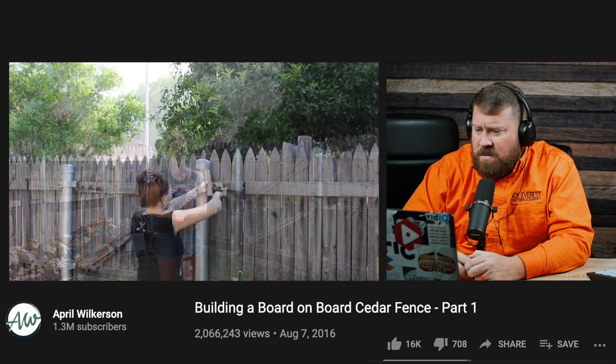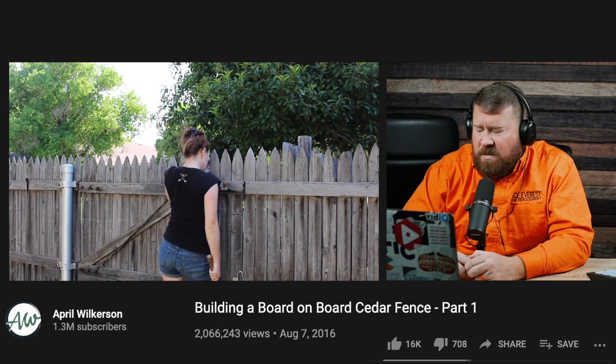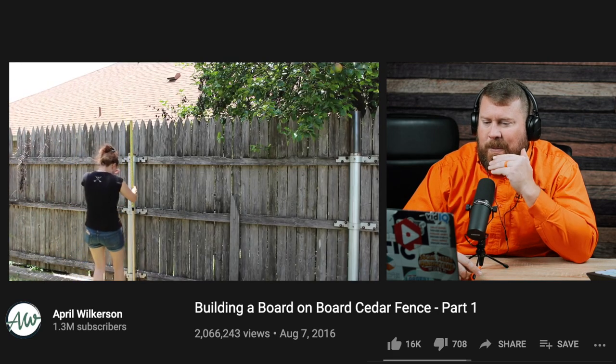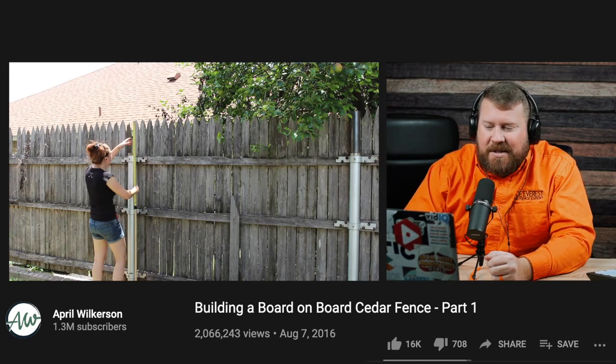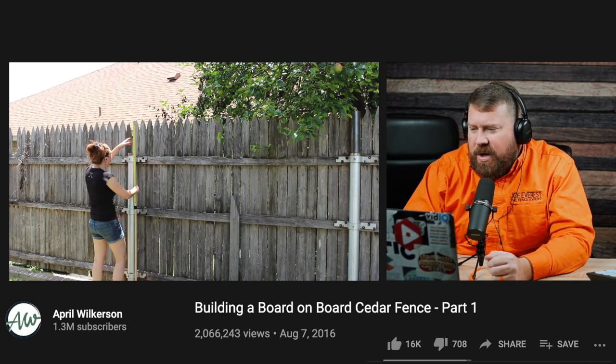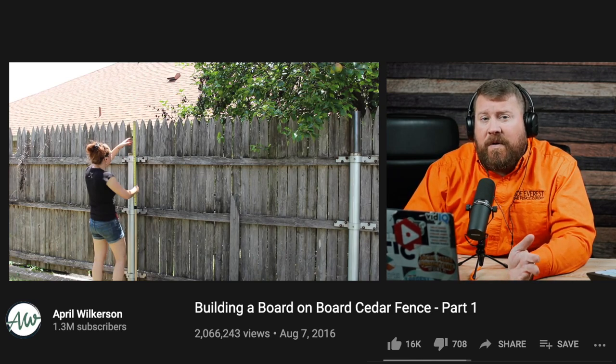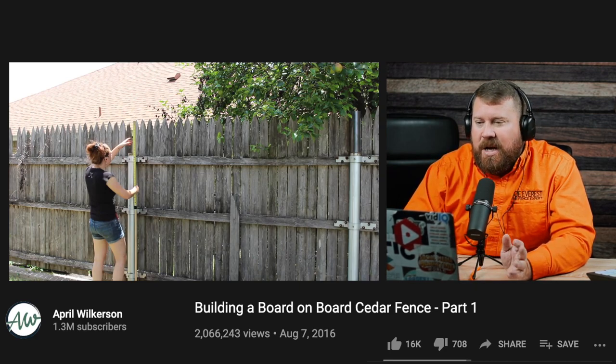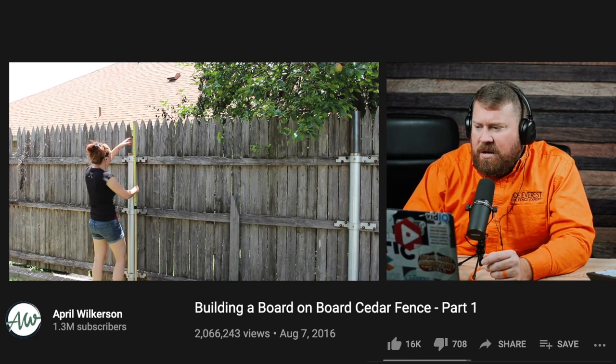And that's actually where I'm going to get started. I first had to go around to all the poles and knock off the PVC cap that was placed on them. Unfortunately, all these poles are not cut to the same height. So what I did is grabbed a stick and cut it to exactly 73 inches. I'm interested to see how she extends these posts — this is a question we get a lot. The question we get most often is if you have a four foot fence and you want to make it a six foot fence, or a six foot up to eight. There's not a great DIY solution to that, so I'm excited to see how she does it. We can see on this right post she already has a piece of pipe on top of that.